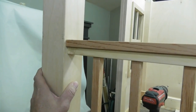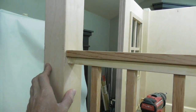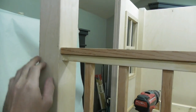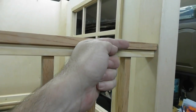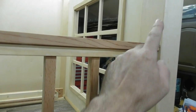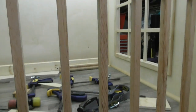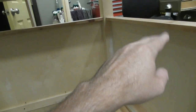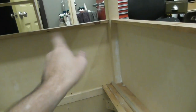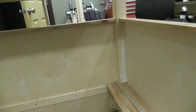The railing is wrapped up — nice and solid. It turned out I didn't need to pull the column on the other end; I just loosened it, took my screws out from below, used the same guide and center to mark it, put my jig on, drilled the hole — no big deal. I've started taking the top apart because I need to remove the headboard and sideboard, glue them up, get the cove glued in, do a little round-over on things, put them back in, and then move on to the last couple of things.